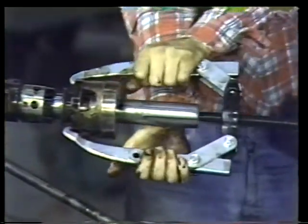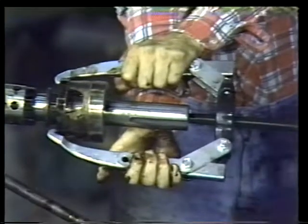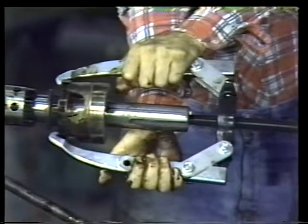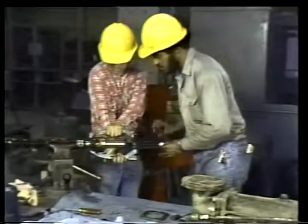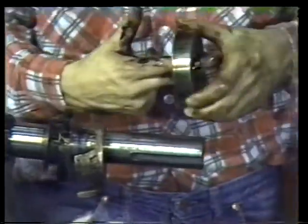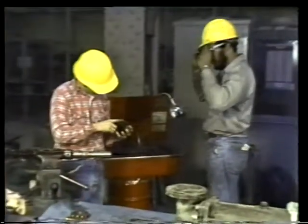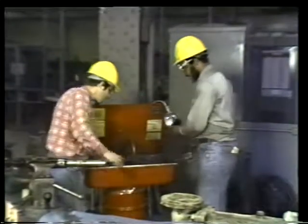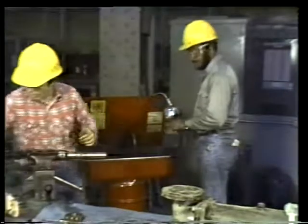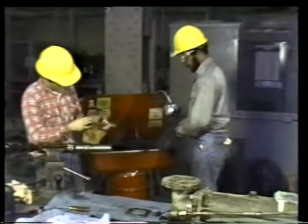You can now finish pulling off the bearing spacer, and stationary parts of the seal. Use the puller until the bearing slides back far enough so that it's loose on the shaft. Remove the bearing and check to see that it spins smoothly. Then remove the bearing spacer and the worn stationary face and seal plate, and set them in the cleaning tray. Remember that dirt and grit can ruin the bearing, so carefully wipe any foreign matter off the bearing and set the bearing aside where it will stay clean.